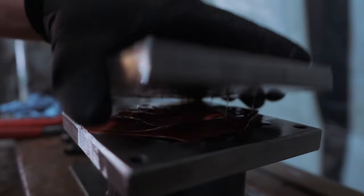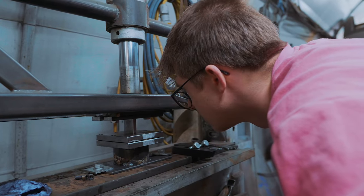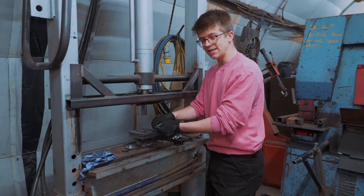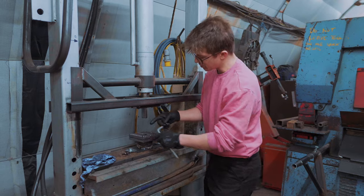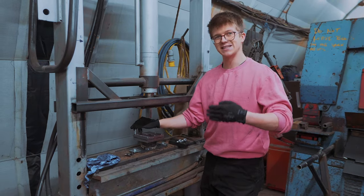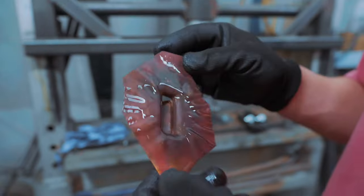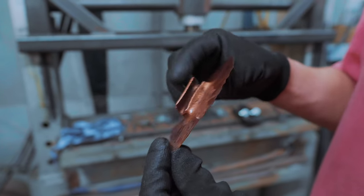Okay, we've done a little bit. No! A proper engineered deep drawing setup would have many stages with many different sized punches, many different sized dies. What we're gonna try is the least costly adjustments, so we're gonna try and make a smaller punch. I must say though, with that midway anneal, that is the best deep drawing we've done so far.